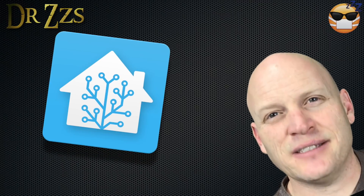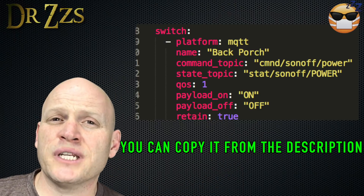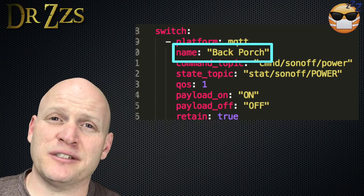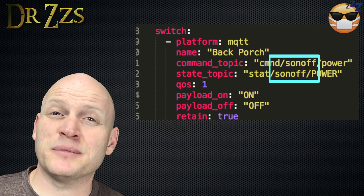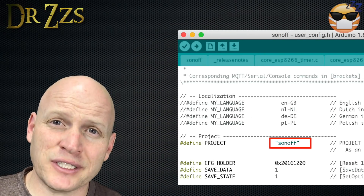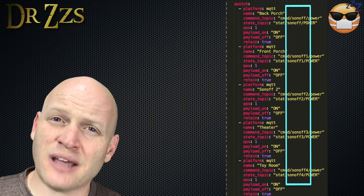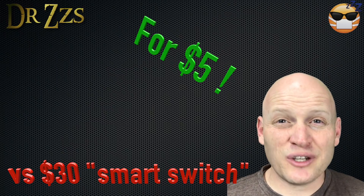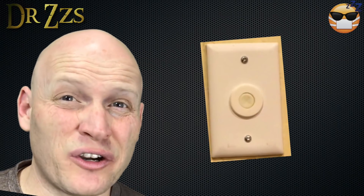Once you've got that all hooked up, tested, and stuffed back in the box, you're ready to set it up in Home Assistant. Go to your Home Assistant configuration file and add this. Whatever you put for the name is what will show up next to the button on your main Home Assistant page. The middle section of the command and state topics is the project name you used when you set up Tasmota. Remember, for each Sonoff you need to set a different project name — because each switch has to have its own unique MQTT topic names. Save it, check your config, restart Home Assistant, and it should work. Now you can control your lights using MQTT with Home Assistant or anything else, and you still have the same functionality at the light switch — and it looks like every other light switch in your house.